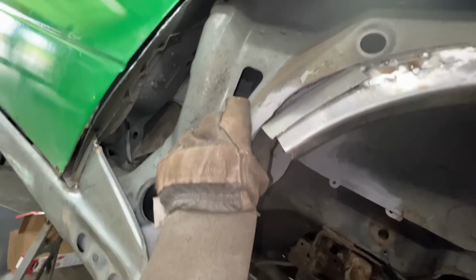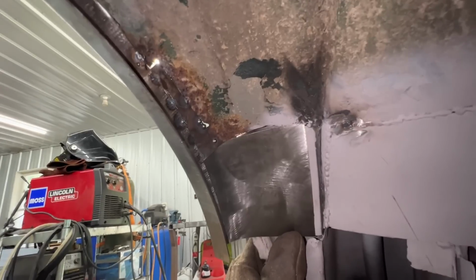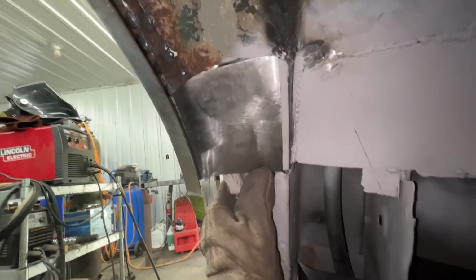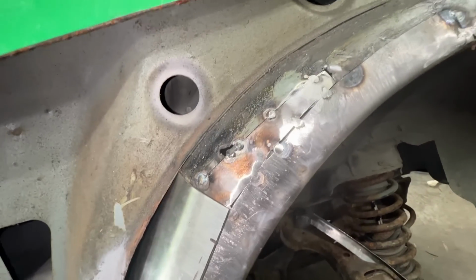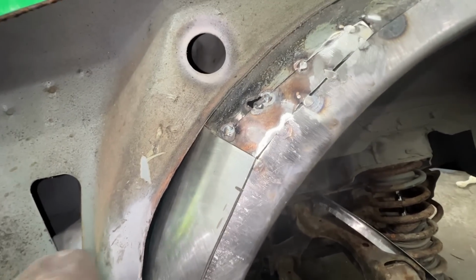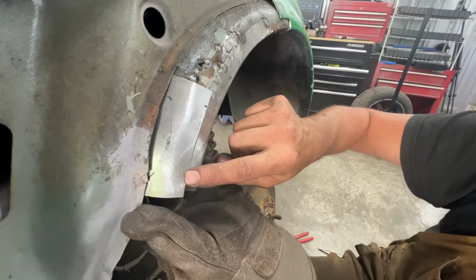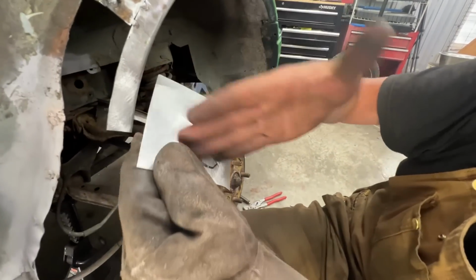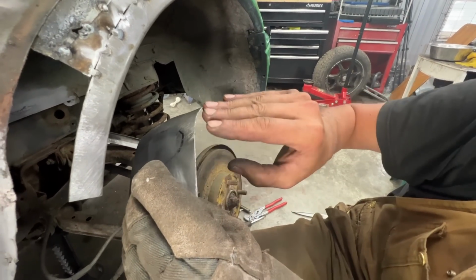Okay, so it's getting close. Inside is pretty well. That was literally 2-3 minutes on the English wheel, and it looks pretty good here. We might work a little bit more on the shape, but the three-dimensionality is pretty good. Only here we still need to go a lot more in the middle to raise this to touch the flange. But probably we're gonna have to shrink here as well, because you see how this curve now opened, because the way I go on the English wheel is in this direction, and the diameter of my wheel is pretty big, so it just straightened this curve.